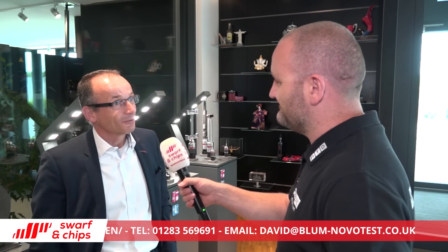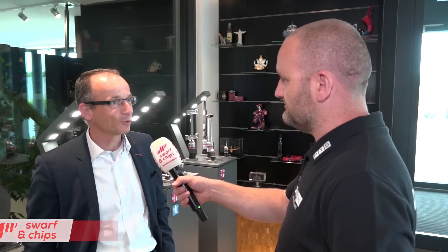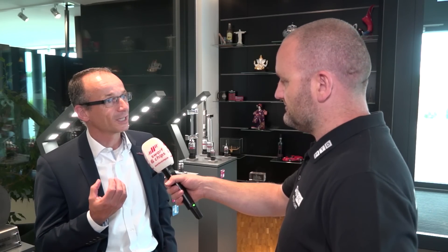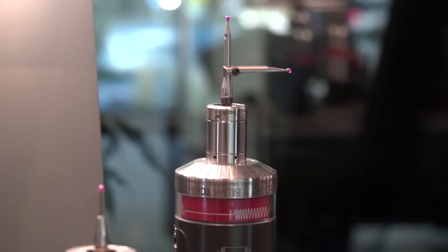But you're not taking up valuable machining time. Engineers can't charge for inspection or setting up tools - they charge for producing swarf and components. So what would you say to that? We are encountered with that quite often when we talk to clients. We take away some cycle time from them, which means we reduce the output on the machine. The key question to a client is: what's more important to you - is it more important to produce as many parts as possible, or as many good parts as possible? The word good is the key word here, because you can only sell the good parts. If you produce bad parts, you can't sell them. So what good does it do if you produce a lot of parts but 10% end up in the bin and you have to scrap them? If you add on cycle time by adding measuring technology, but at the same time you're able to reduce or even eliminate your scrap rate, then you have a higher output on the machine.